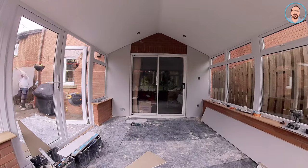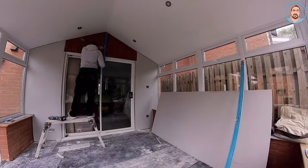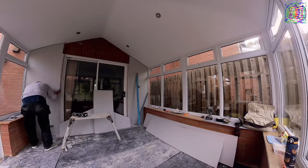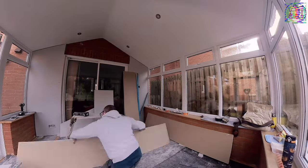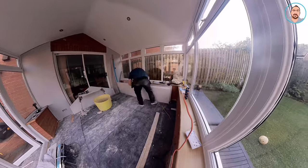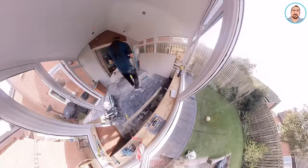What you'll see me doing — I've got this big piece at the top. You need to get a nice level across and make sure that you've got somewhere that the boards can hang on. I'm cutting down the sides so there is a bit of a lip so that when I cut the next board, I'm going to be leaning it on top of that. I was using my level to make sure I'd get the points in the right direction. The next part is making sure I've cut some boards to go in between the plasterboard and the frames, keeping margins the same all the way through. I'm marking boards with chalk or wetting them with water, and I use my multi-tool to make this a lot quicker and smoother.